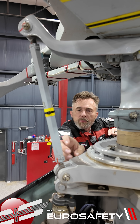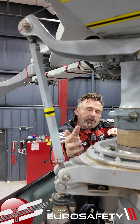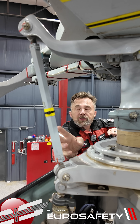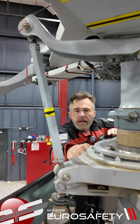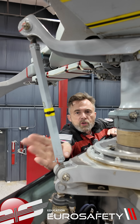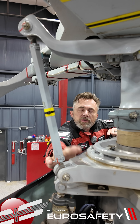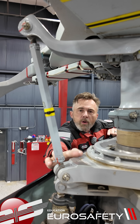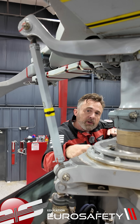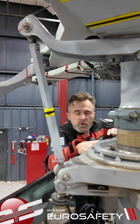We've had a lot of questions recently regarding the temperature of the rotating swashplate on your AS350 and EC-130 models of helicopters as it relates to the high temperatures we're having outside. We can touch this when it's really hot outside and we don't know what too hot is. So what we're going to start doing is measuring the temperature before and after a flight as it relates to the skin temperature of the helicopter, and we'll try to determine somewhat of a norm.